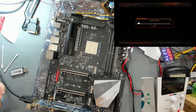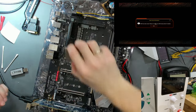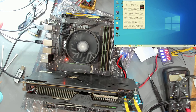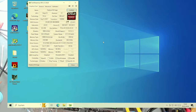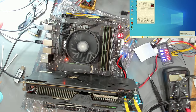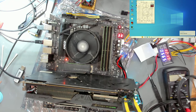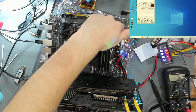I'm very, very happy to see this. I'm going to do the usual - get my 2600X in here, get a big GPU into the first slot, get all the RAM populated, and then get to testing. As you can see we're currently running in Windows through an M.2. We have our graphics card at 16x 3.0 - I think this is the max that this card can support. I cannot believe this board is working. It was just that one chip that was shorted - the small ITE chip that was dragging down the 5VSB line.